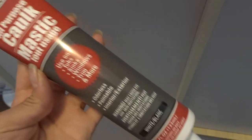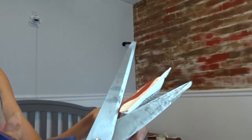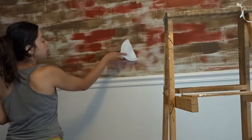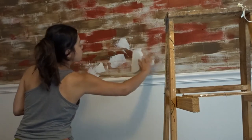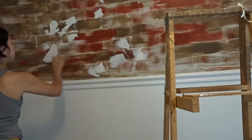Once the paint has dried, I use some caulk that I purchased from Dollar Tree. The caulk says it's odorless but it does have a slight odor after opening, so I did have to wear a mask to help not breathe in the fumes — but it's not very unbearable. I use a little bit of the caulk with a spatula, making sure to go across and then doing a criss-cross type of motion, then up, down, criss-cross, and horizontal again. This helps make it look more believable and achieve that German smear look that is very in right now.